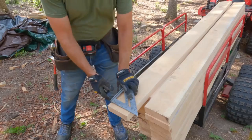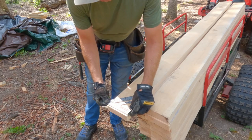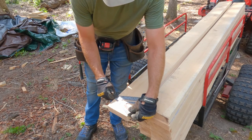If they do, oh, actually, I can put two on one end like this and like this. If they fit, that's great. And then I'll put them on the far end, do the same thing. If those fit, then of course I can make all of them the same. I thought I was doing a 6/12 roof, but I measured something funny and it ended up being 5/12. So I'm just gonna go 5.